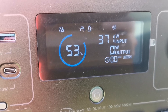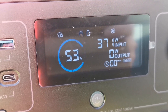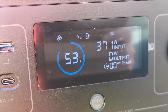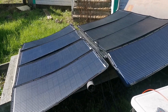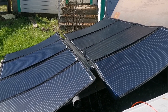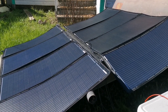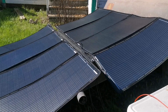I was kind of hoping to get to like 500 watts or so. I'm not sure what the deal is — maybe I should return these panels. I really wanted to get to about 650 watts, and this is just over halfway there. But the math does check out: I was getting 180 and 170 individually, that's about 350 combined, which is roughly twice what each one does on its own.